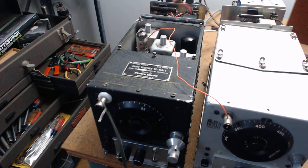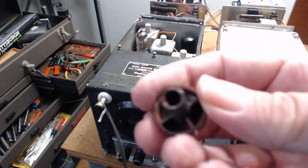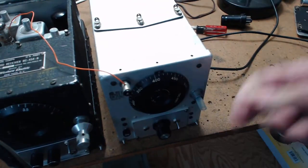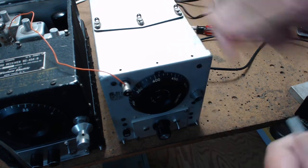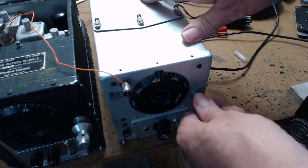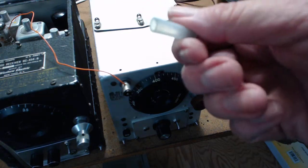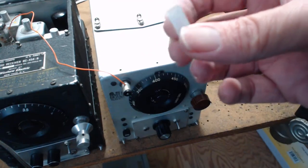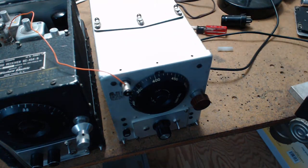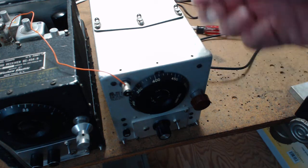There are also old radio knobs with a spline inside that will also work on this radio. But this ice maker tubing works really good - that's my idea. Other guys tell you to glue a piece of copper tubing on with Duco cement, but ice maker tubing is the way to go. It's sold at Lowe's or Home Depot by the foot. I had some from CNC machines I had - I tried it and it worked perfectly.